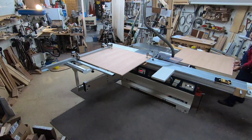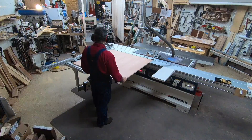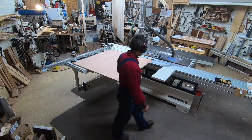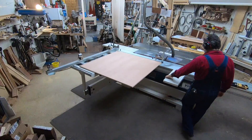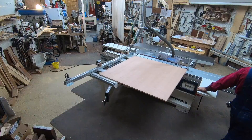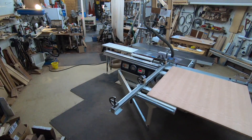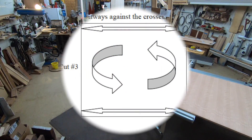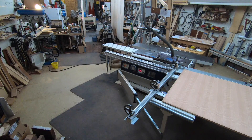I like working with a 4x4 panel — it's easier than a 4x8, less room for error, and yet large enough for incredibly accurate results. You just saw me cut a sheet in half, and that's cut number one, the reference cut. Cut number one only needs to be done once, and that edge becomes what I put against the fence from here on.